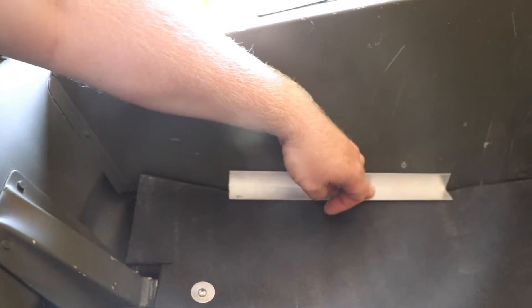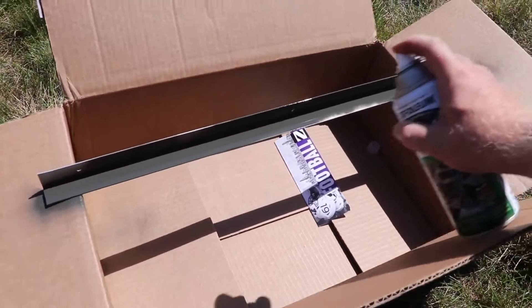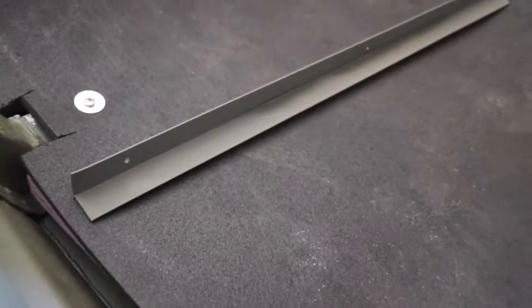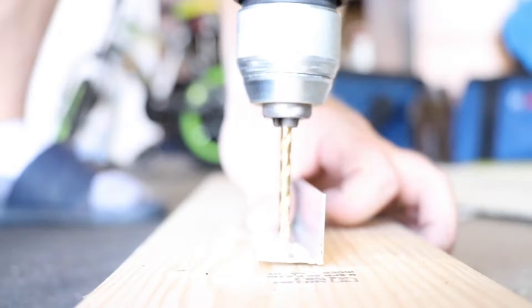We're on day three of this flooring project. Instead of wood, I'm going to frame out these corners using a piece of corner aluminum — like this — lay it in there and screw it to the decking. My dad suggested aluminum over wood because the wood would rot over time. I'm going to get that painted — I screwed a couple holes in it and I'll use some self-tapping screws to screw it to the deck.